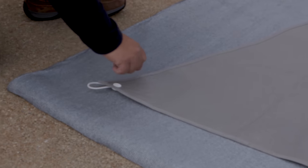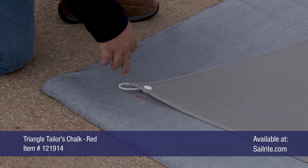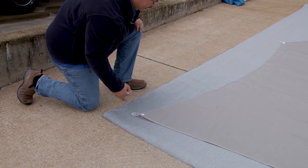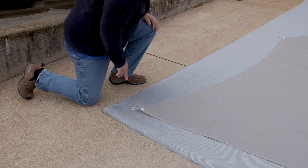I'm going to mark the corners just by making a triangle at each corner. And then where the hollows are acceptable, I'll actually just trace around the perimeter. Now remember we have to add an allowance for hem, and we'll do that later on at the loft table. So I'm going to do this at every one of the corners.